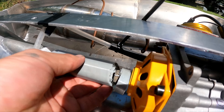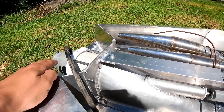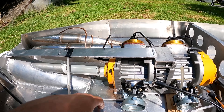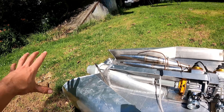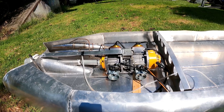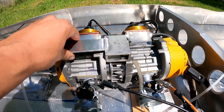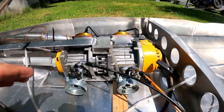I've only printed it at 10% infill by the looks, so I have to print that solid. I might print some more of these parts solid as well, but that's hours and hours of printing. The cooling does have water in it — it just started working but the jet wasn't running properly so it's not going to cool. I'd like any suggestions from you guys. Also I need to start lock-tightening stuff because this engine mount shook itself loose. The engine ran good — it's a shame the carburetor came off too.